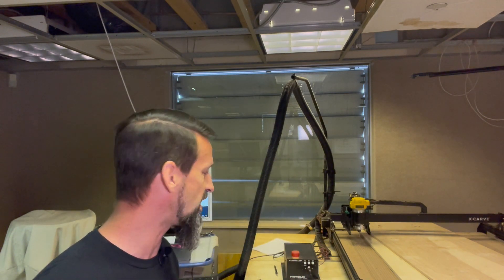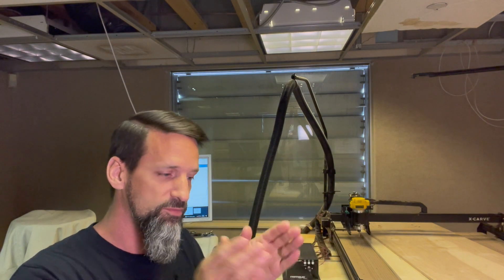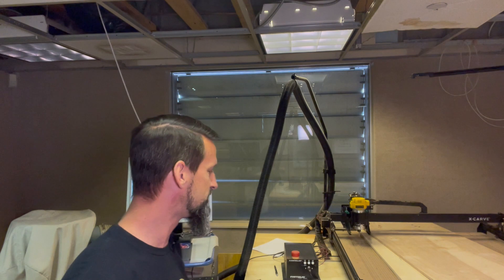I'm going to be sharing this file out with you. One thing to keep in mind: I have this design with my specific metal ball guides that I got from Marco Specialties — they're not the common plastic ones. I'll probably do another version of the file that has those more plastic inlanes that most Sterns and other machines are using. The spacing on the post holes for those is a little bit different, so if you download this file you'll be able to use it, but you might need to adjust those holes a little bit. If you have questions, hit me up.